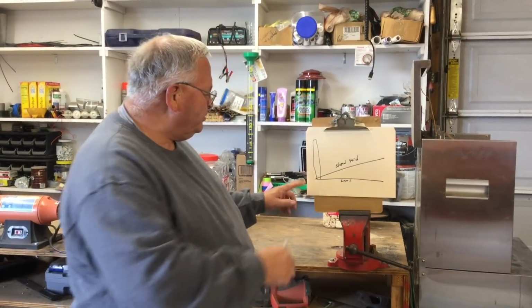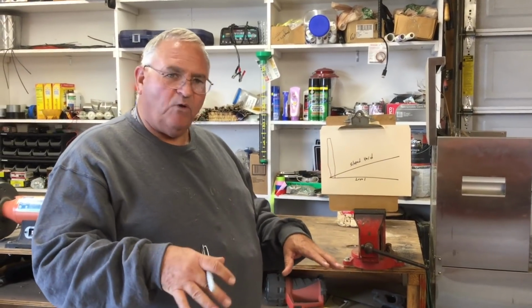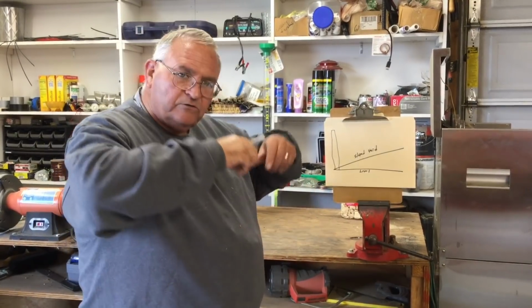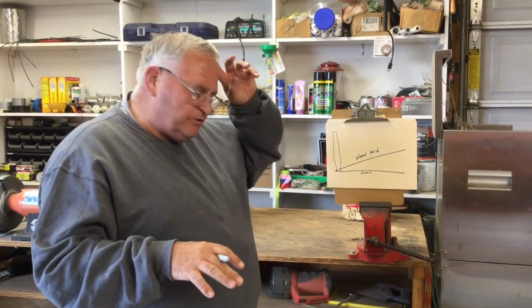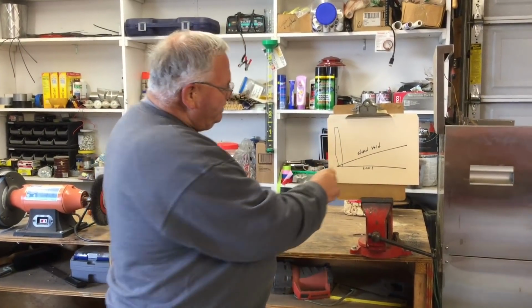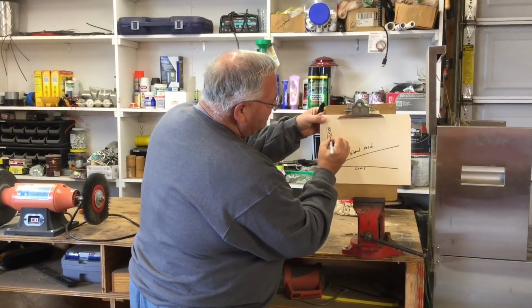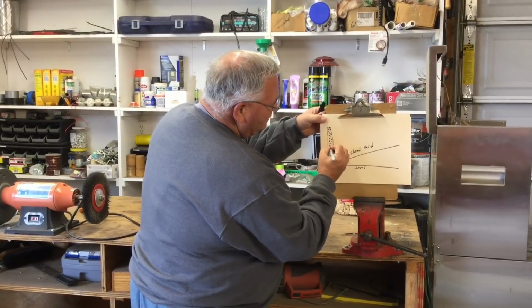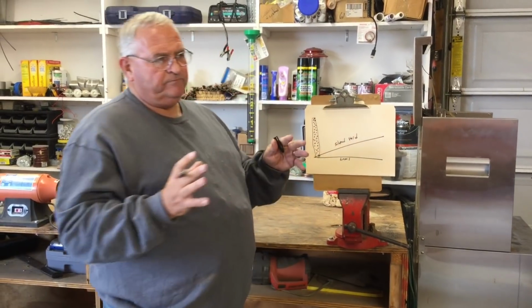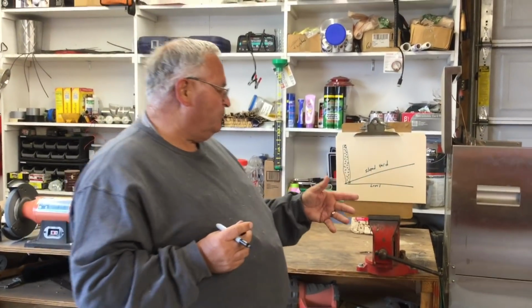There's a couple of ways you could do it. You could put catch basins here that are open, and you can see down into them, that the water can get into, or you can make a French drain where the water can seep into some stone that you installed there, and then it can get dispersed that way. So basically, what I did is I put in a French drain, and these little circles here, I'll show you on the other side in a second more about the French drain. A French drain is kind of an invisible trench, an invisible drainage system, somewhat invisible.